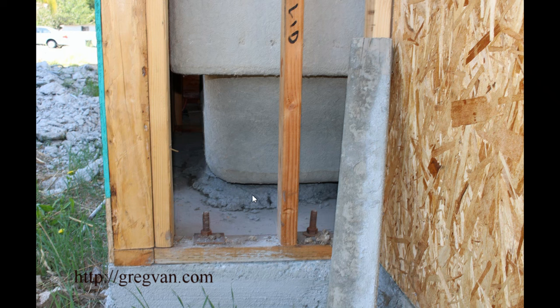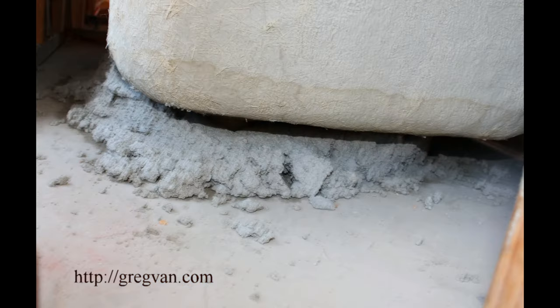You can't use mortar that is too wet. Remember, concrete will shrink — and this isn't concrete by the way, this is mortar. You don't want to use concrete; you want to use a mixture of sand and cement. You can see here where it has actually shrunk away.